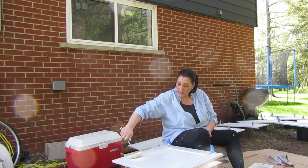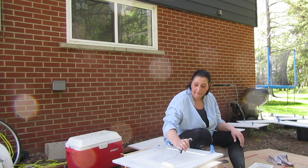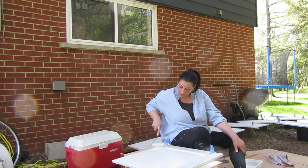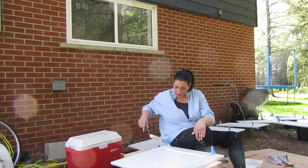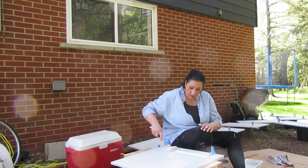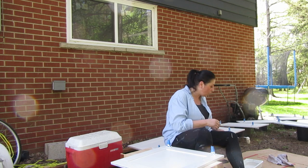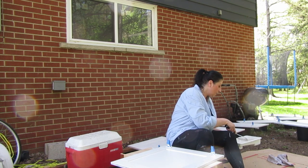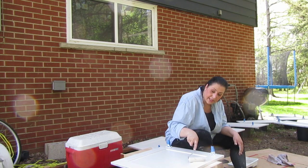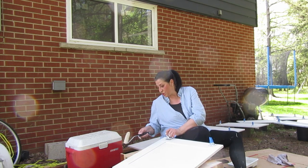It works out fine. Now the cupboards in the box cupboards and the drawers I'm going to be doing inside on the spot. Then if I need any touch-ups or finishing coats, I'm going to do them on the spot as well so that they won't be handled after and they have a chance to really cure. You don't want to put a protector over this paint until it has a chance to cure. For this kind of paint to fully cure, I'm going to say 2 weeks. So while these are hanging in the kitchen, you'll have to go easy. You have to be careful not to knock them too much or rub them too much. I mean, they'll be dry. They just won't be fully cured.